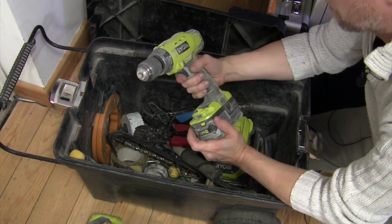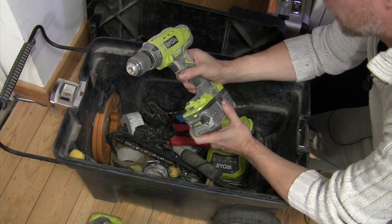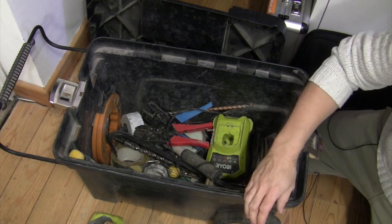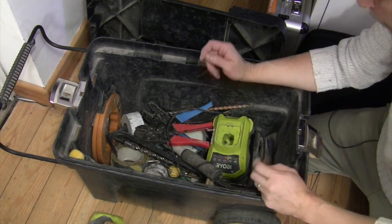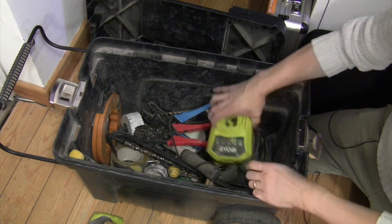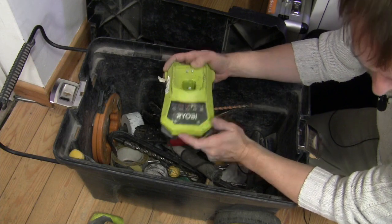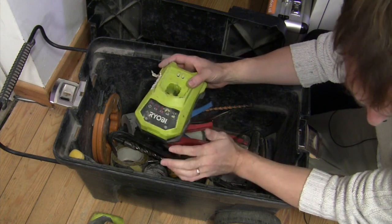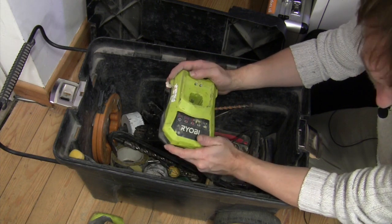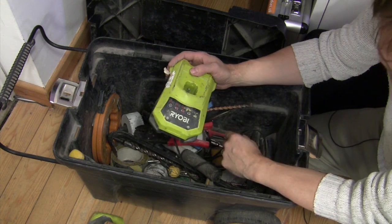The standard drill — this is the second one as I mentioned earlier. I burnt through the first one, but it did do several years and it was my fault burning it out because I was drilling through a chipboard floor at the wrong speed with 100mm holes. Fast battery charger — getting a fast charger is essential when working out on site. A lot of drills, my own included, may come with a charger, but it'll take all day to fully boost up one of my 5Ah batteries, whereas this can charge one in about an hour.